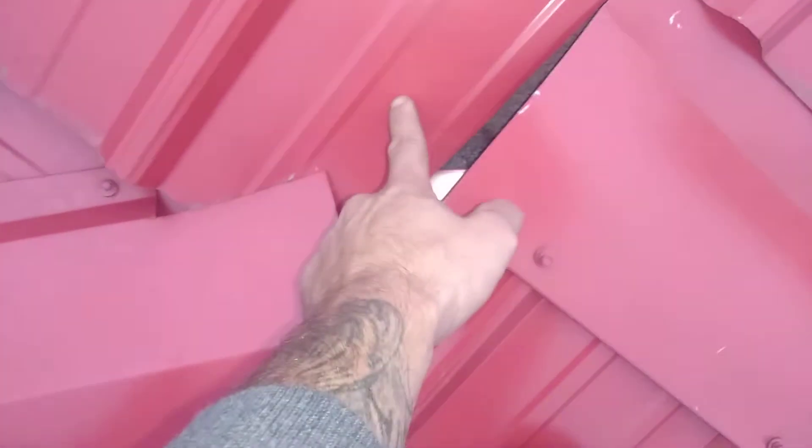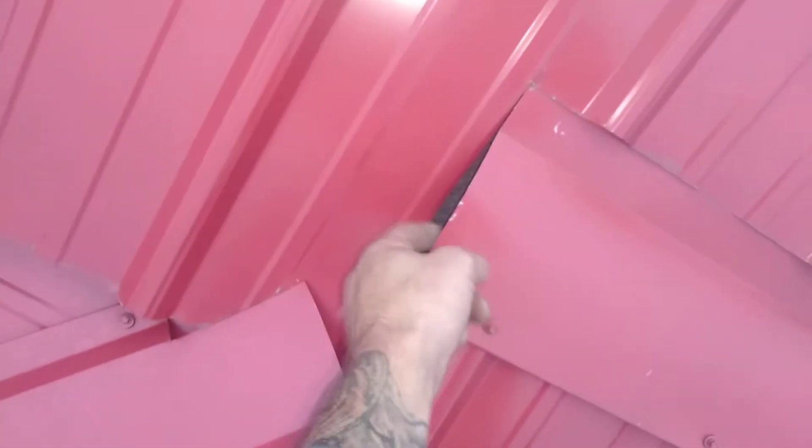That corner needs to be cut — we have a piece here, a piece here — it's almost like they ran out of metal. We have shingles, and water that comes off this roof should go underneath here. This piece should be up far enough to catch the water because right now it's on a downhill slope, so every bit of water that comes off this roof goes inside.